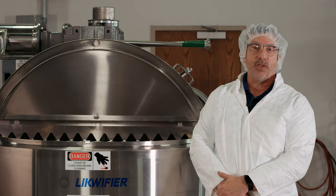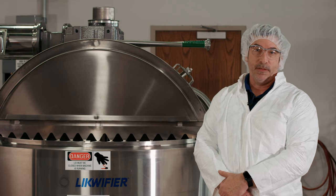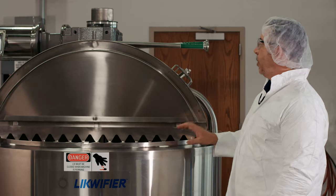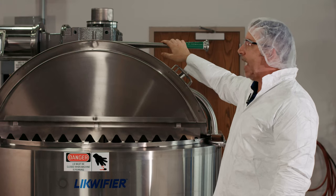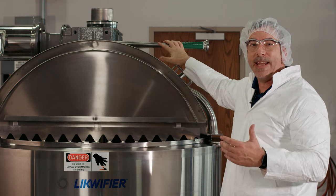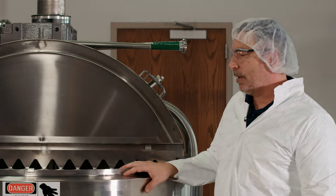This unit has a scrape surface so we can do dual agitation — blending below with the impeller while also blending with the scrape surface. This model has a split-level top that comes completely off, giving you free access to bring products into the product zone. We also have a gear drive with a stainless steel motor combination, running the scrape surface agitator at 20 RPMs. This prevents burn-on during heating and helps with slow agitation for high-viscosity products.